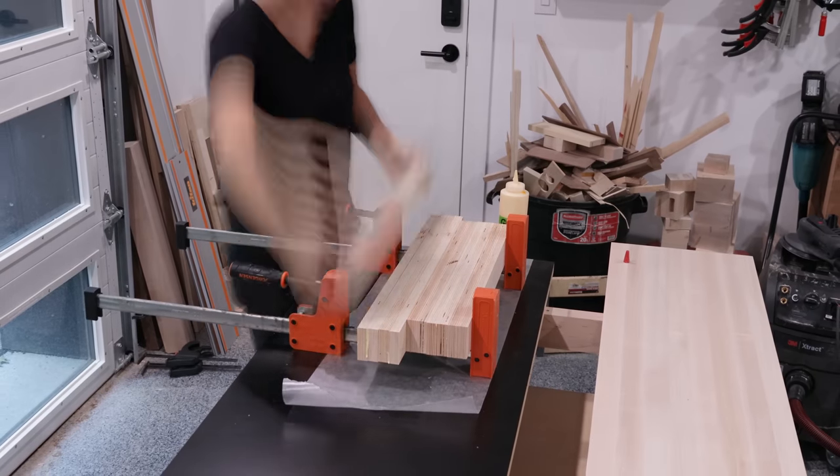Finally it's time for finish. I knew I wanted something easy to apply that I could just add more of whenever I needed to, so I went with Minwax Antique Oil Finish. It's my first time using it, but it's basically like a wipe-on poly. I made sure to finish both sides of the bench so it doesn't warp. And those walnut drawers look good. The final step was attaching the tops to the base using three-inch lag bolts through the recessed holes I drilled out when building the base. And it's done — well, almost done. I still have to put another coat of finish on and a layer of wax, but it's basically done.